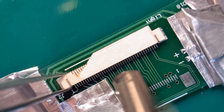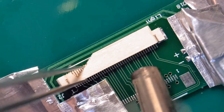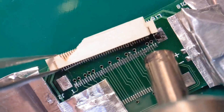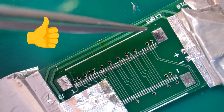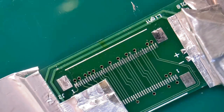It's already getting loose - I can see it moving. I'm just going to slide this off now. I've slid the connector off. As you can see, all the pads and the end fixing pads are all in perfect condition, just need cleaning up - get rid of all that solder using solder braid. That's how easy it is with a hot air gun. The main thing is just be patient - don't try to remove it too early or you could take the pads.